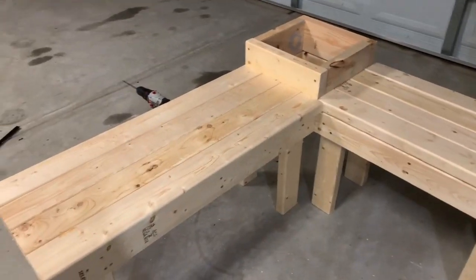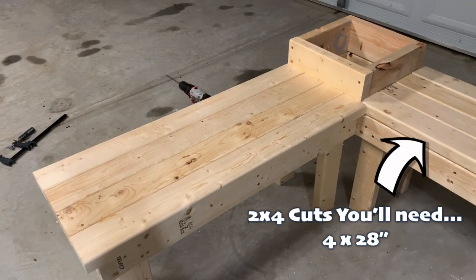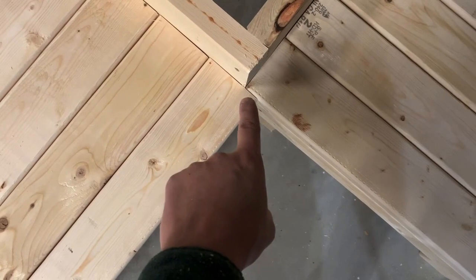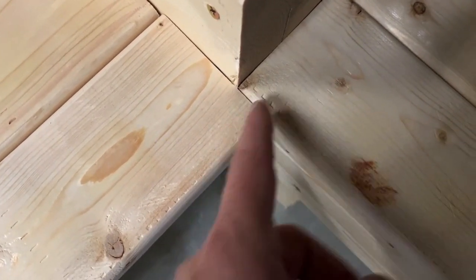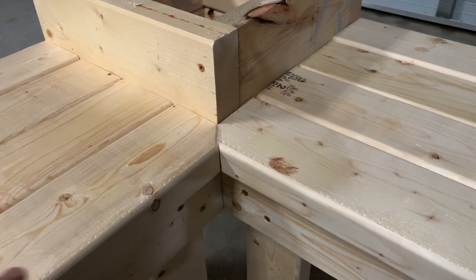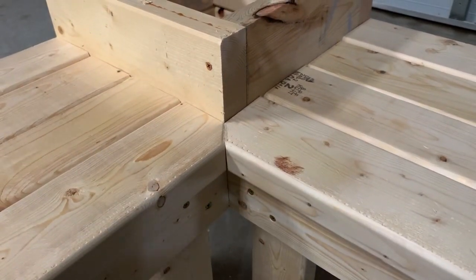So here's where we're at so far. If you see right here, it's perfect — everything is exactly like I wanted. It's going to hang over one inch on each side. But here's going to be the problem, and I already know how I'm going to fix it. So right there, that is going to be an issue. What I'm going to have to do is create a 45-degree notch on this board and a 45-degree notch on this board. So I need to do a 45 here and a 45 here. Check it out — these boards are now cut. I cut a 45-degree notch right here, and now this board in the back is flush. And on this side, it is flush as well.